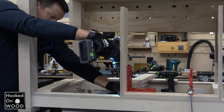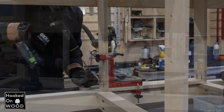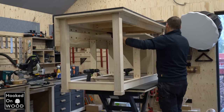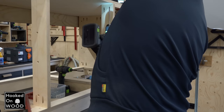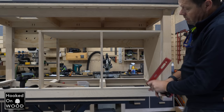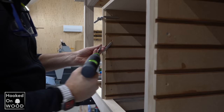So far for the background information. To be efficient with wood, I did not make a cabinet and slide it into my workbench frame. Instead I made a frame of small strips — at least those who are not inside. To get all my drawers at the same size, I created a template that I use for all my workbenches, which are not more than four strips of wood representing the width of the drawer blocks. I saved these because they are my reference. This way, it is very straightforward to get all the drawer blocks at the exact same size. Using these small strips saves a lot of expensive birch plywood, and you can see that I did not use a bottom in the cabinet. The frame of the workbench is sturdy enough, and the rigidity will come back when we add the MDF drawer sides. One last check if everything is square, and we can proceed.